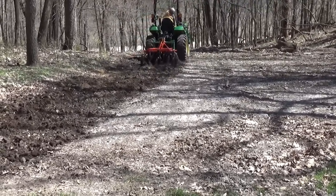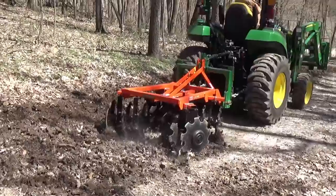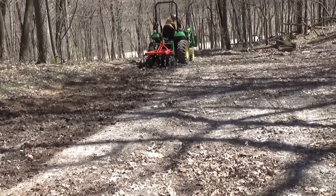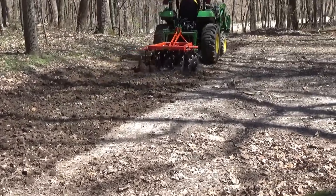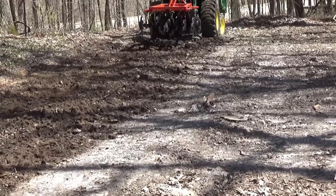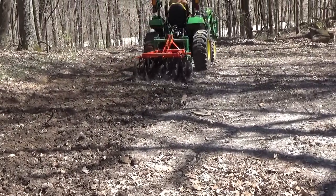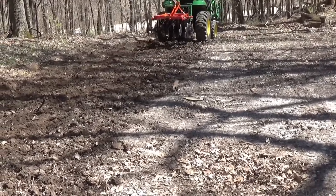The disc plow here is fairly level — looks like it's riding across the ground level. Reading from the brochure: the truest way to level your disc from front to rear is to observe from behind the center. In most soil conditions, a slight ridge in the center is actually a level operation — more air pockets will form where soil is thrown against each other, causing a small ridge that will disappear after a soaking rain. I recently purchased a power top link and I'm excited to get that out — it'll eliminate me getting on and off the tractor to make fine adjustments. Thanks to Ty out in California for helping me choose the right one.